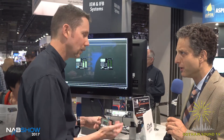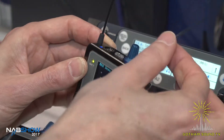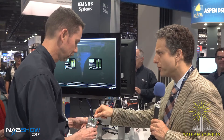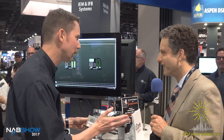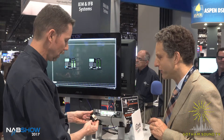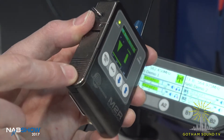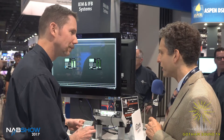I have a slightly controversial question — if I was in a studio and wanted to distribute audio to cameras wirelessly, can I put that on the back of a camera? You would simply take an eighth-inch jack to XLR or whatever the camera's input might be. It's a diversity receiver, very high-quality, good range, and plenty of audio fidelity for that purpose. The volume knob cannot be locked out, so you'd have to tape it. It's not really designed for that, but it would work. This is the same chassis as the LT transmitter, so accessories like the belt clip and battery eliminator are already available.